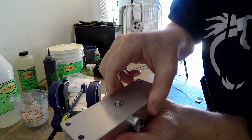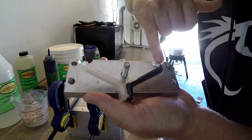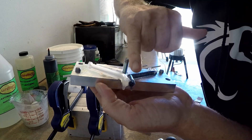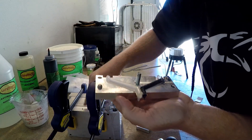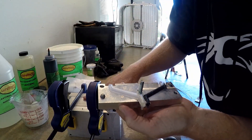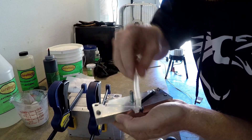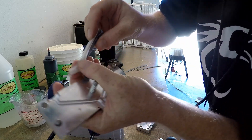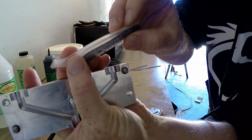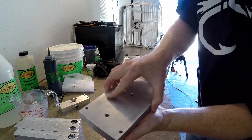You can see how this blending block works — it literally just takes the two streams of plastic and shoots them into the mold. You have to know which way the baits are positioned inside your mold, so you know which half you want each color. That's kind of what you get — and that is what you hope your bait looks like. Let's see what we have.